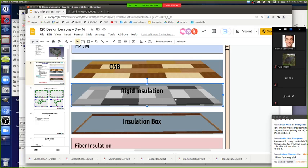That's kind of like detail. Like when we actually build it, we do want to pay attention to it. So we actually do want to cut it up so that the pattern is exact. It's not like, do we cut this into 2 feet or 4 feet? No, you got to cut some so none of the seams line up. If they line up, you've got cold breaks, cold bridges, where air can get in. So when we do the actual CAD, you want to design it so no seams overlap.